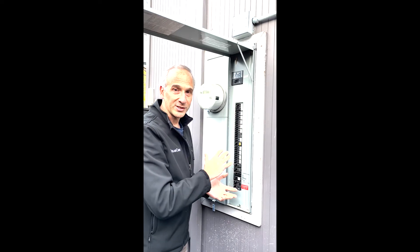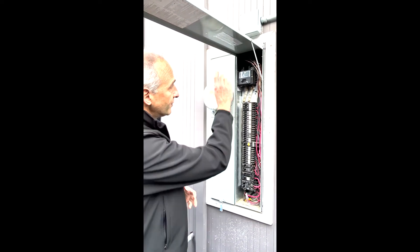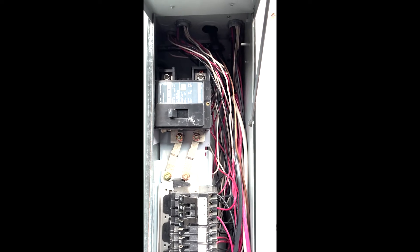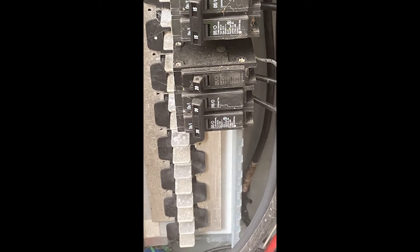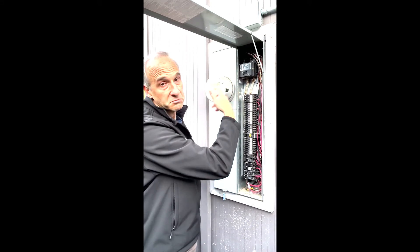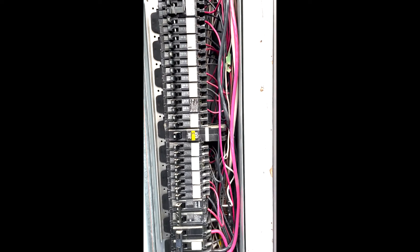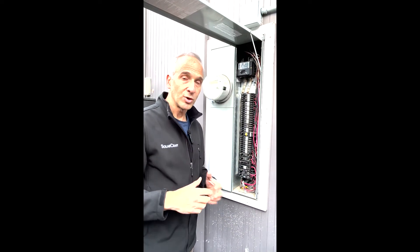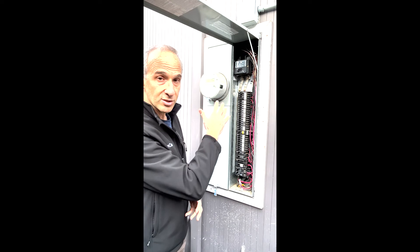Now I'm going to open the main panel and show you what's inside. Here on the inside of your main electrical panel, you have all your breakers and your main circuit breaker up top. In this configuration, you have two bars coming down that connect the main to what's called the bus bar — a bar of metal in the back that connects everything together so all the circuits are connected. Often they're wires instead of bars, but they connect the main breaker. All of these wires are for individual circuits inside your house. I do not recommend that most people take that front off — it's called a dead front, and it's called a dead front for a reason. It can be dangerous in here; this is all live and you don't want to touch that.